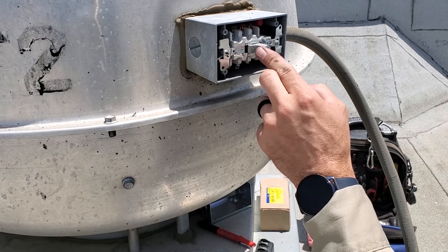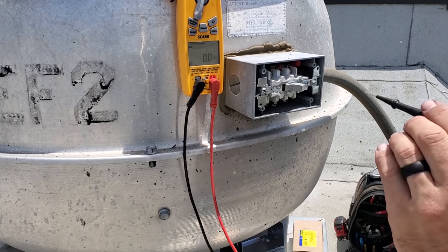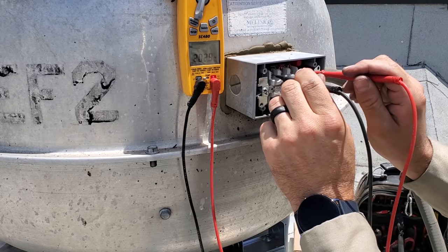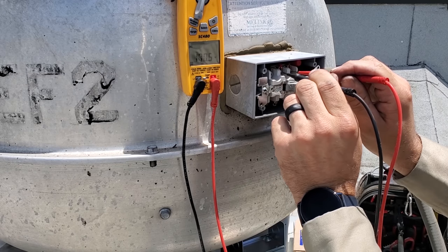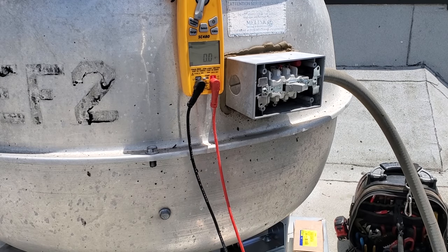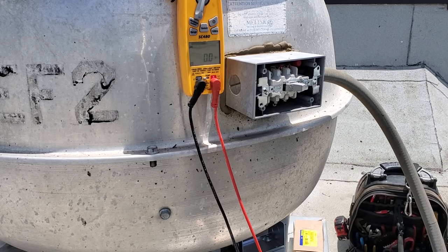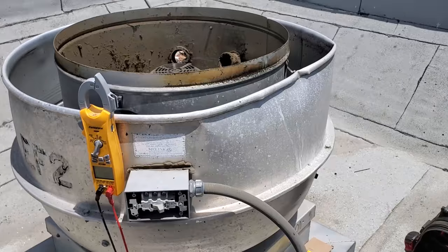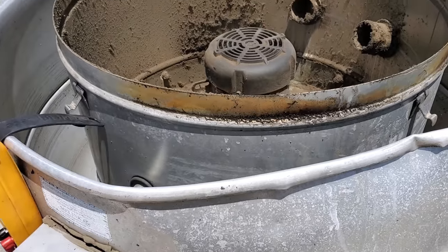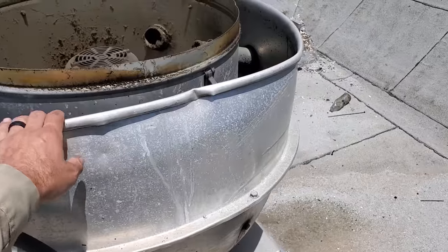I'm going to turn the power back on, move the switch off, then test the motor. Let's fire this guy up — first we're going to check voltage, make sure we've got three phase coming in. Yep, three phase coming in, nothing shorted. We'll find a better place to check current draw. Let's see if this guy fires up without blowing up. One, two, three — please don't blow up. It's running! It's got a nice little vibration to it, but it's running.